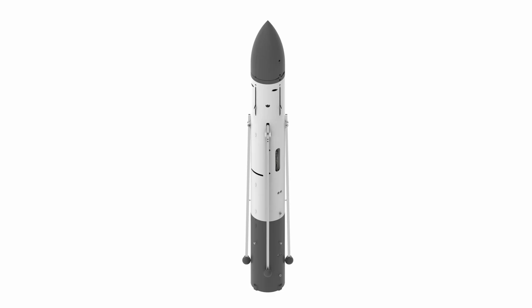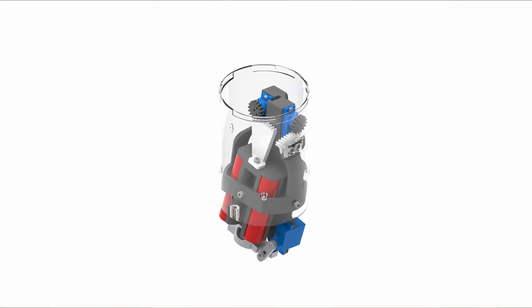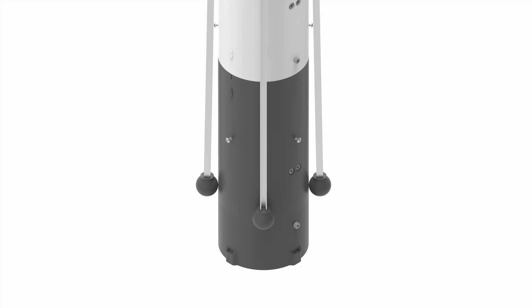Now it's time to draft some new concepts to fit all these constraints into a single modern rocket. Here's the rough first idea I have in mind: to be able to launch and land the rocket, I figured it would be best to make it two-staged. Both stages should feature TVC control for stabilized ascent and descent. I approximated the rocket will have a mass of about 1 kg, which is why I foresee engine clusters of 5 at both stages. The stages shall be held together by a rubber band that I want to cut by burning through it with a heating wire.